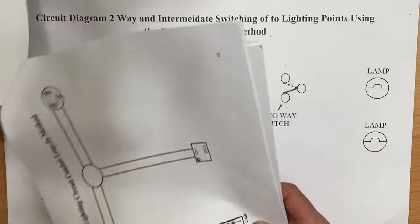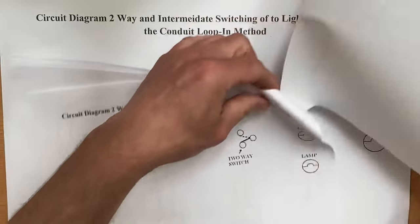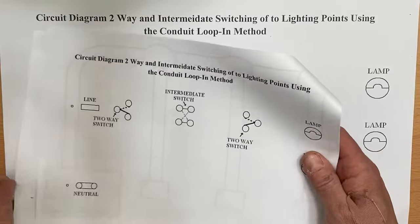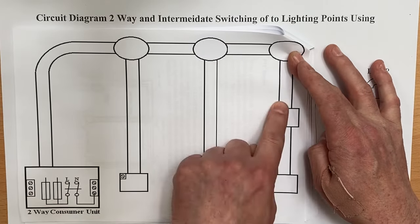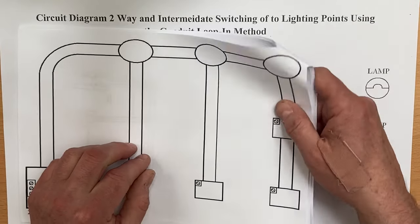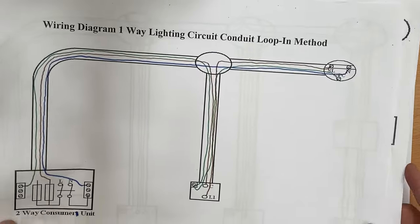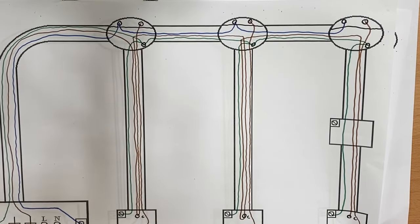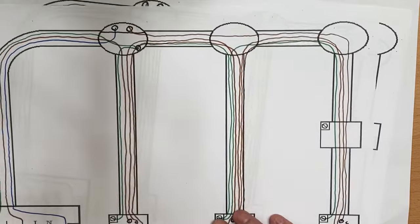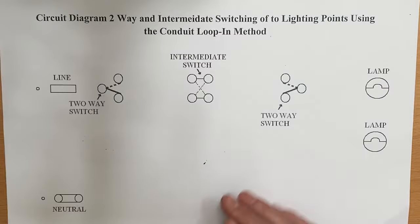There's a marking criteria as well as some diagrams we've worked through. We're going to be working on a new one today, and the final one in the pack is the layout I'd expect you to build — three lighting points and four switches. The wiring diagrams start off simple and progress to quite complicated circuits explaining where all the conductors go in relationship to the lighting points. If you're jumping in at this stage, it may be worth going back and watching some of the earlier videos.